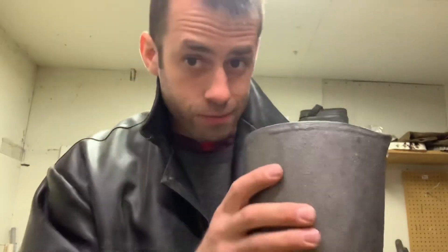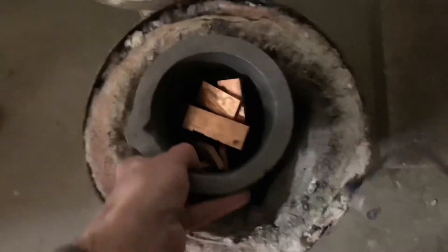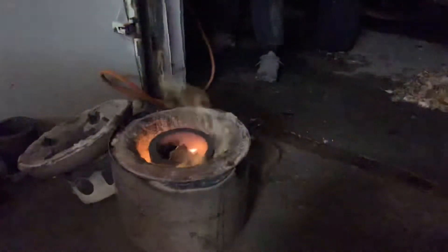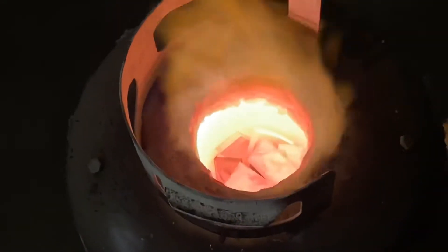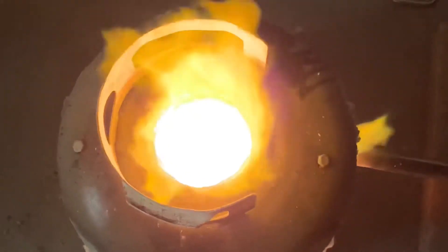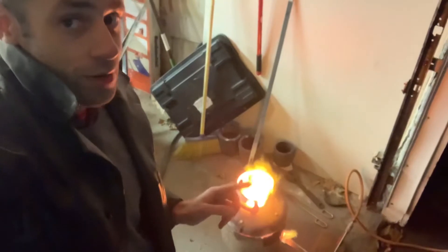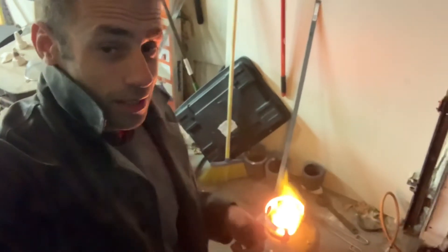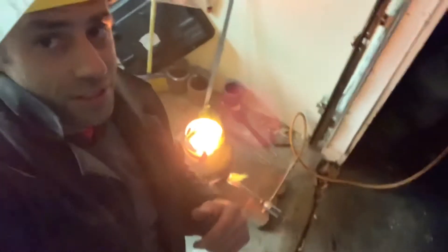Freshly tempered brand new crucible. In order to get this to mix properly I'm told I need to hold it at around 2,400 degrees Fahrenheit — that's what I'm shooting for. It's right on the edge of where it needs to be; it's 2,300 degrees right now. Just a little bit hotter and it'll be in that range where the iron is supposed to get amalgamated into the copper. It's hovering around 2,300 degrees — it's just not getting hot enough for the iron to mix. The iron's still solid. Dang it.